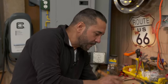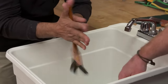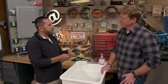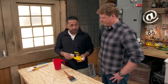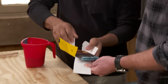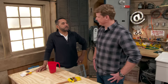For drying, use a clean rag for a couple of dabs, and use your hands — they do the job just fine. Give it a spin and you can feel the droplets coming off. The bristles will fluff back up. After the brush is dry, let me show you storage. Every high-quality brush comes with a cover whose size matches the brush. A tapered brush gets a tapered cover; a two-and-a-half inch brush gets a two-and-a-half inch cover. Velcro it up, and the brush is good to go again for the next job.